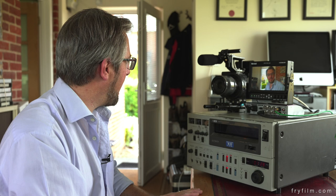So as a comparison, now that it's running — this is the HD from the FS700, which let's remember is a 4K chip downconverted to HD for recording purposes. It's going via this box to standard definition and composite into the U-Matic, and this is the U-Matic picture. Now what you might see is obviously there's a huge change in resolution between HD and standard definition. Also we're recording analog composite video onto an analog tape in an analog machine. So the HD here on the FS700 is recording digitally to solid state card — no tape, no analog processing — it's all digital HD video. And that's been converted into standard definition analog, and that's what's going on to the tape now.